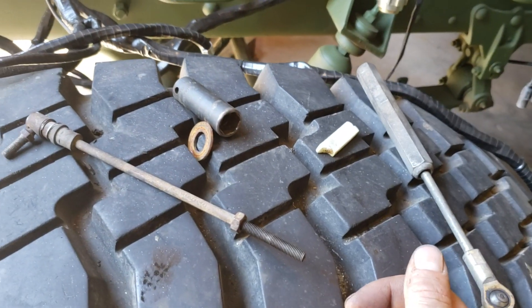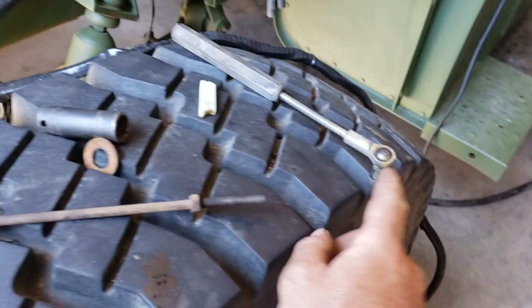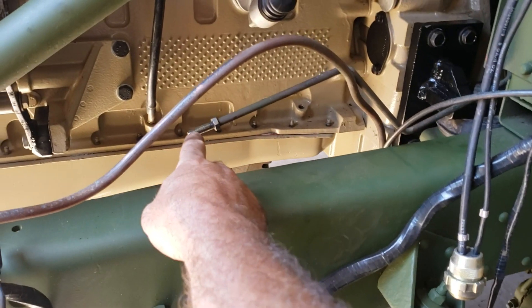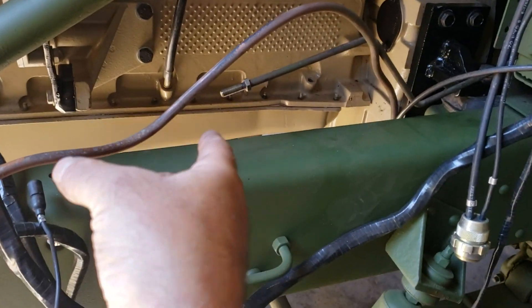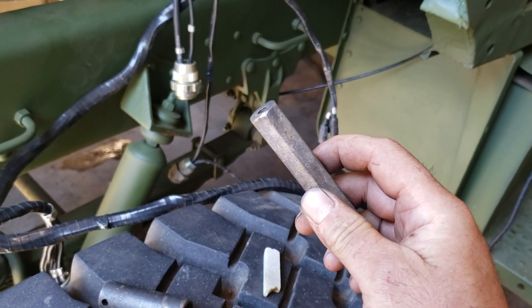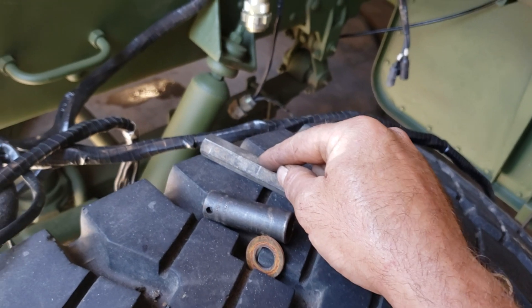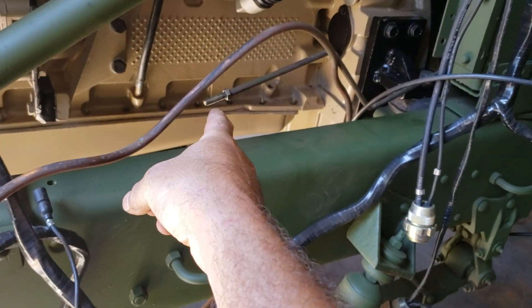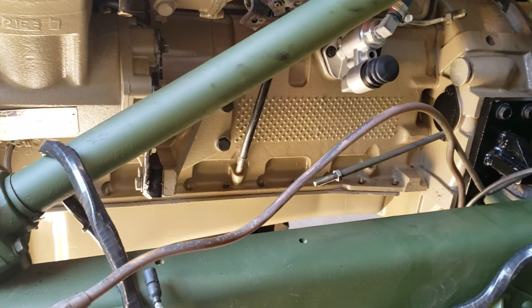Or I could go to the hardware store — Steins in the Ritter — which I know sells little heim joints just like that. So what I can do is get a heim joint with a threaded shank and a collar. I need to find out what this thread is — I think that's probably 5/16ths coarse, but I'll find out before I go. And I'll get a heim joint with a thread that matches that, and a turnbuckle nut — I keep forgetting the name — a collar like that in approximately the length I need. If it's too long I can cut it, if it's too short I won't buy it. And if the heim joint with a 5/16ths thread has a bigger hole than that, then I'll just ream that hole out to match, nut and bolt through it, of course with a nylock nut, and I should be good to go.